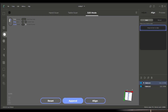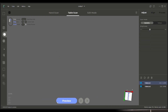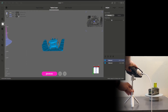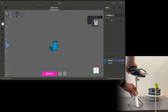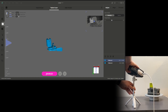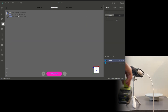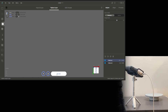I want to scan the top section that's been missed on both previous scans. Press reset and preview once again as we realign the scanner and item. This time I'm focusing the center point on the top part of the battery, using the chart on the left to determine whether I need to be closer or further back. I'm also experimenting with the brightness for this particular material since it is slightly reflective. If you change the position of the scanner or the table, you want to reinitialize — it's now only capturing a small part of the table. Put the item back in the middle and start scanning.